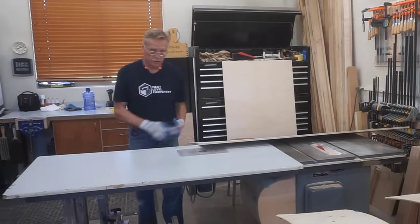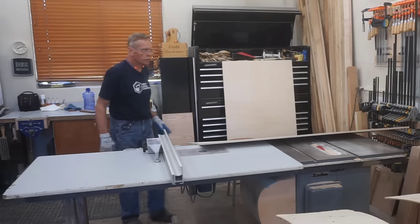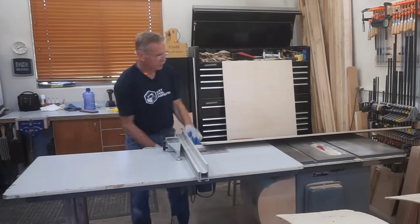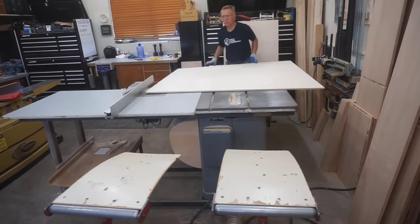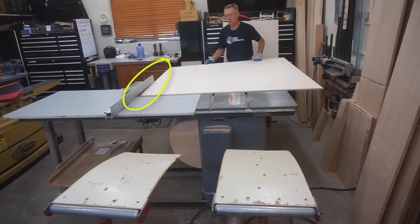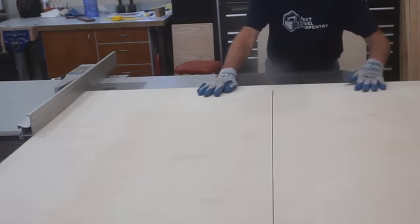And I might clean up a dozen edges before I ever find one rock or flaw in that edge, but it's worth it. And let's see, 31 inches is my number. Gives me plenty of margin for trimming. Roller stands are about set. I'm pointing to the rip fence where I have to make sure the workpiece doesn't rock on the fence. It has to be indexed and sliding smoothly exactly along the fence for accurate cuts.